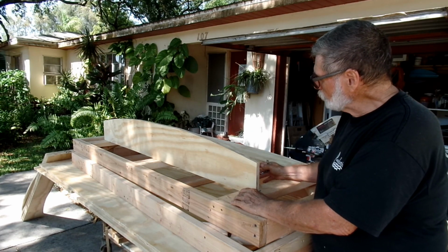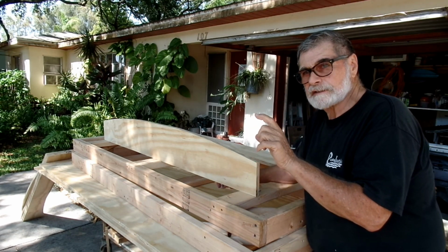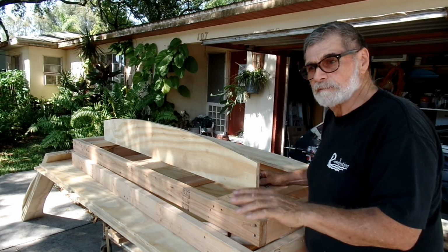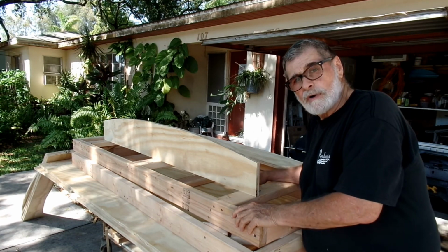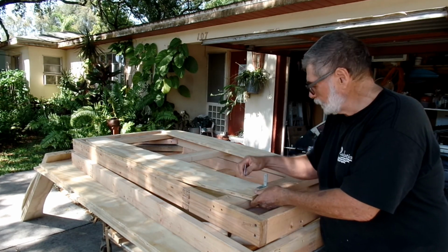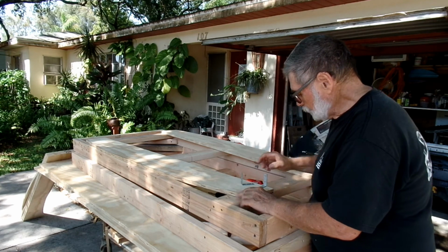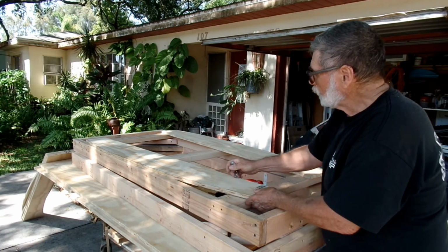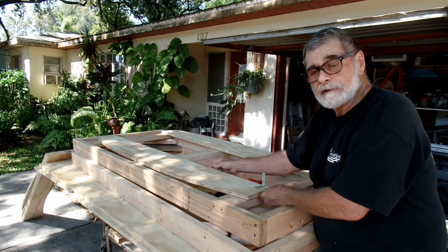Now the three on the bottom, the center one will give us the concave because we're going to put a little shim on that, raising up enough to give it that little concave that we want. And we can adjust that concave by changing the different sizes of shims that we put in there. And that will be shown on tomorrow's video, or the next video. So we're just gonna drill them out. We're gonna put a center drill so they don't move around, and then just put the screw in it, and then that's it. And then we'll be able to fasten them down here, and then we'll be able to move them in and out to get the desired effects we want to get.